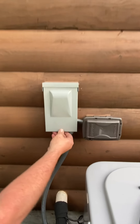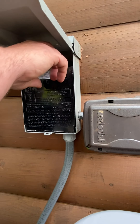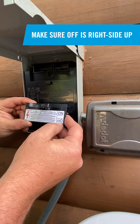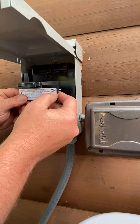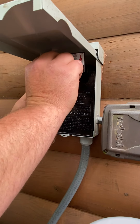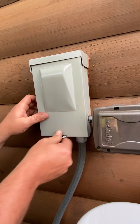With this particular system, it has this particular disconnect. To turn the power off, it's simple — grab this and pull it. If you notice on this disconnect, it has nomenclature on the side showing 'on' and 'off.' Off happens to be upside down; on is right side up. Insert it right side up and the disconnect is on; insert it with 'off' right side up and the disconnect is off. For today, we're going to put this back in the off position to start our work.